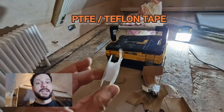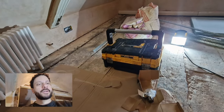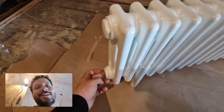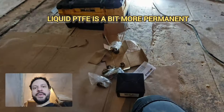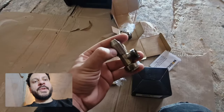I'm going to use PTFE on this occasion because the customer is a bit indecisive — they pretty much change their mind every other day. They might look at these and think they'd prefer white radiators, so I won't use liquid PTFE because I need to be able to remove it. These fittings are pretty nice though.